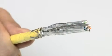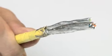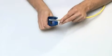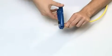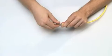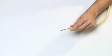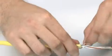The brown and blue pair should be crossed on the other side. Remove the foil shield to a depth of five millimeters. Make sure that the remaining foil encloses the pair of wires tightly. Now open the wire pair and flatten the individual wires.